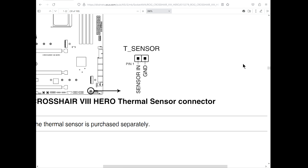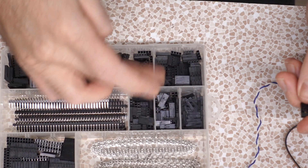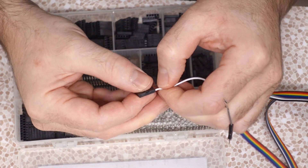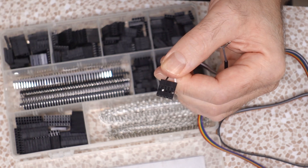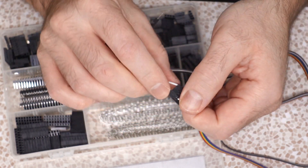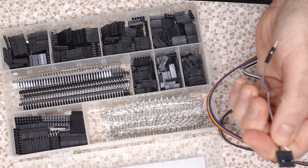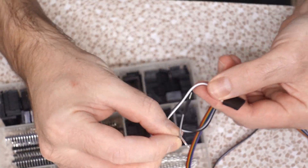I've got to look at the manual — if I scroll up a bit we're going to come to the USB connections. You're gonna see 5V USB, and USB is almost always putting out power. Then we have ground — not connected — but the top of this header is 5 pins. So obviously this comes with the little other parts. I've got to configure this face up. Pin one is positive which is going to be the white, as is the tradition. Black's going to be negative. And I'm keeping with a 5-pin header so that if I accidentally plug it in upside down, the positive pin's going to go to NC and the ground pin's just going to end up on a data line — so there's a little bit of reverse polarity protection.